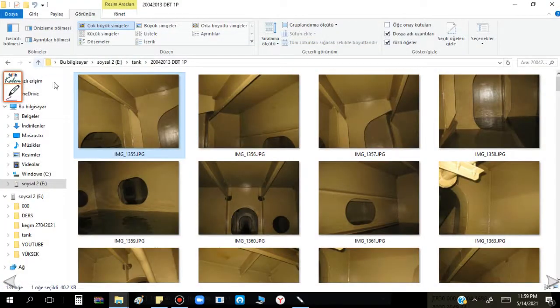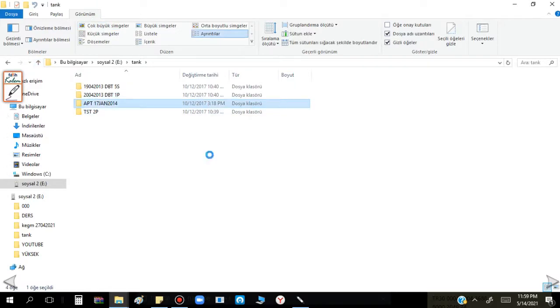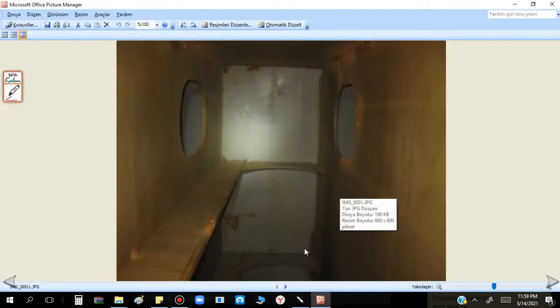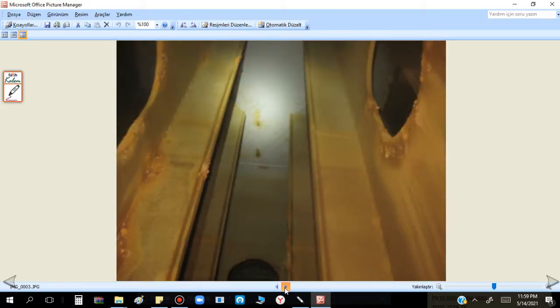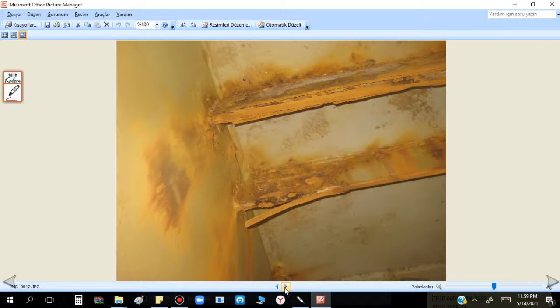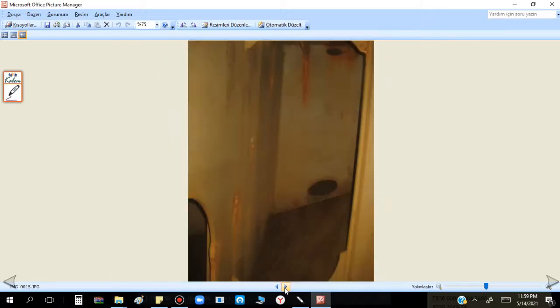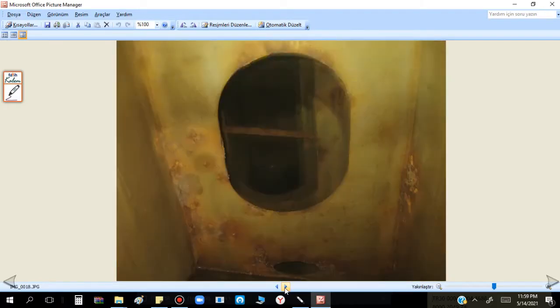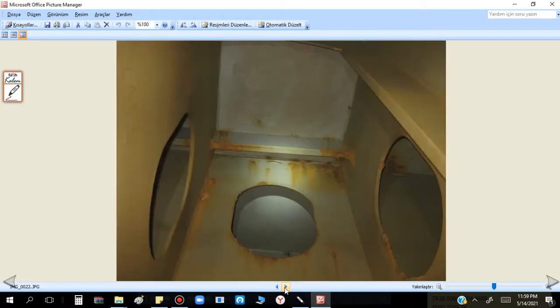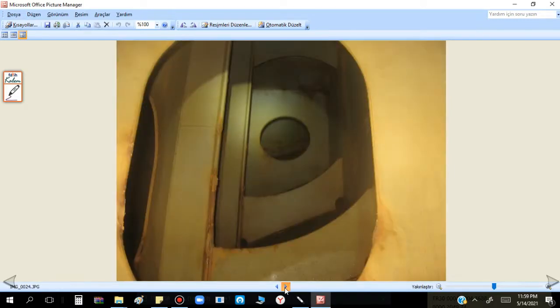This is the after peak — my least favorite. After peak is the most difficult because it has the smallest cells, and because of the vibration it is always rusty. Too much rust in the after peak — this is normal, my friend, nothing to do for this one. We just take photo and report. If any major problem, we try to repair. But don't forget — after peak is always rusty, always, because of the vibration.